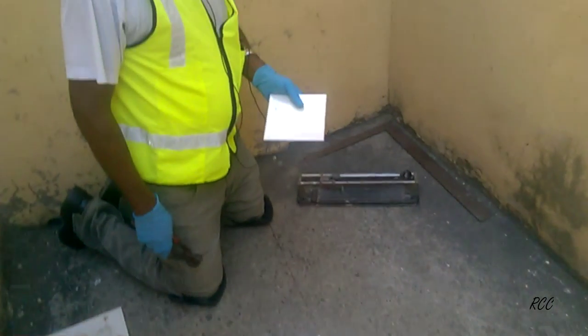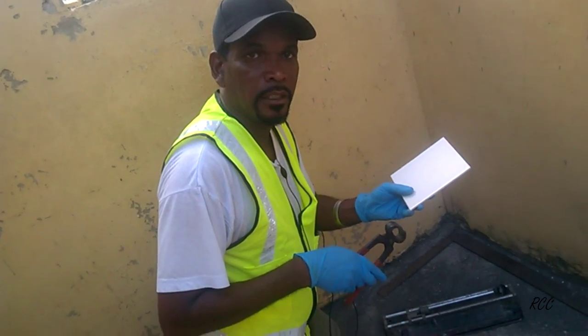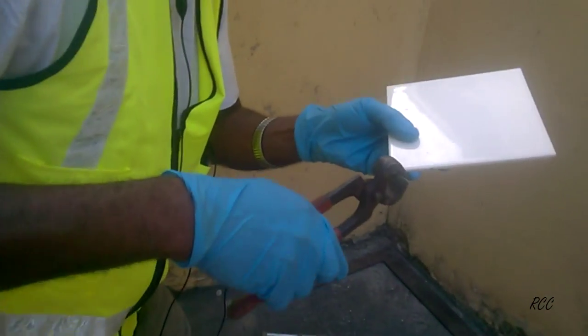You'll also need a nipper. This is used to take small pinches from your tile where the angle grinder or the tile cutter isn't able to do that job. You'll use a tile nipper — a pincher — to pinch away small bits and pieces from the tile. There are different brands, so as a do-it-yourselfer you'll choose one that is ideal and reasonable in cost.